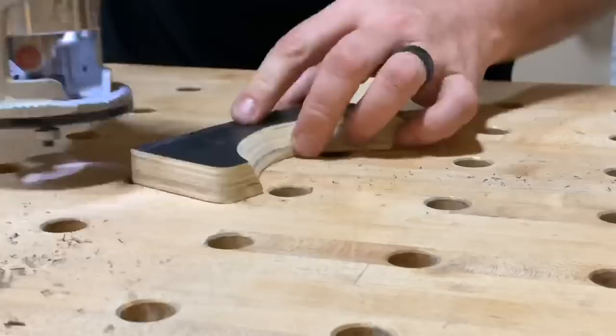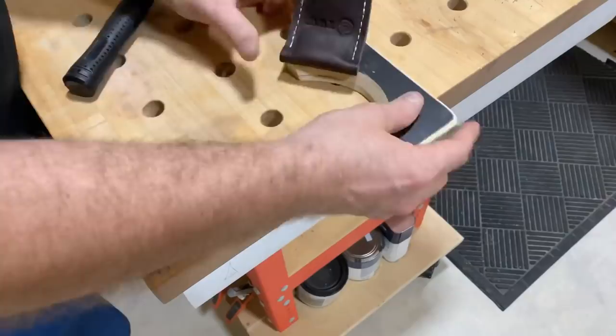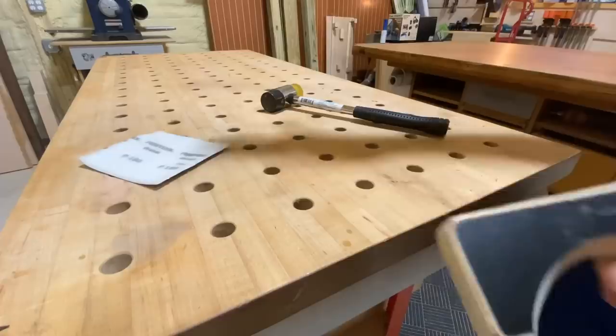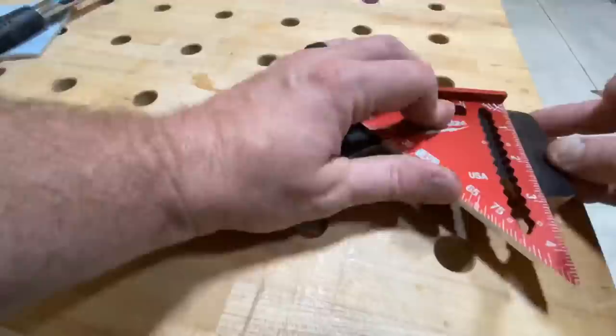So be patient, enjoy the ride, and just kind of wait and see what happens. After putting a quarter-inch roundover on one edge, I'm going to go ahead and ease all the edges. You would never think that I would use bench dogs with hold-fasts, especially with leather protective gear on them. I've come a long way as a woodworker — these just make really handy work of holding pieces down that ordinarily would be a bit cumbersome. After repositioning the piece, we're going to do some final sanding with 180-grit sandpaper. Now it's time to make a few marks for some countersunk holes.